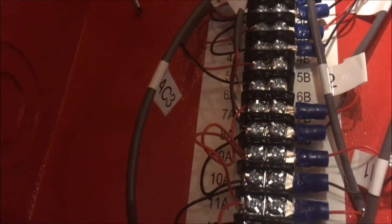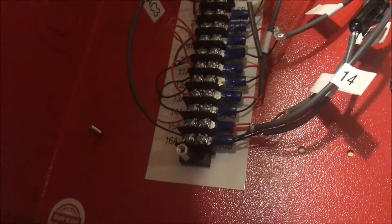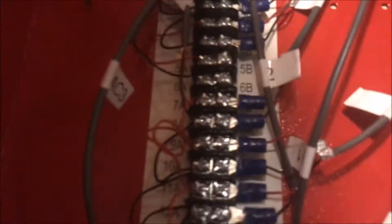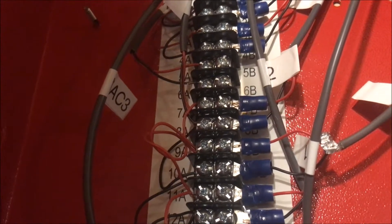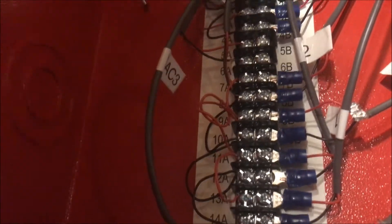Same goes for my NAC — NAC 4 is my big one. NAC 4 comes in positive, negative, positive, negative all the way down, then NAC 3 is its own separate section. It makes it easier to move cables around. If say I'm running a TrueAlert here and a regular horn there, they have to be on separate NACs, so I can take the two spades and move them down to NAC 2 so each device can be on its own NAC.